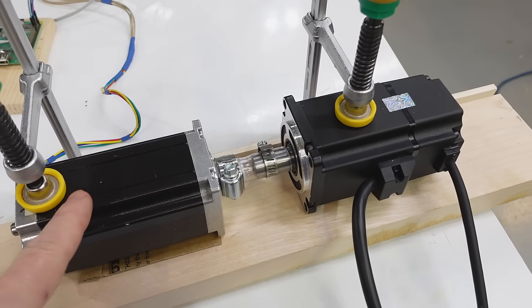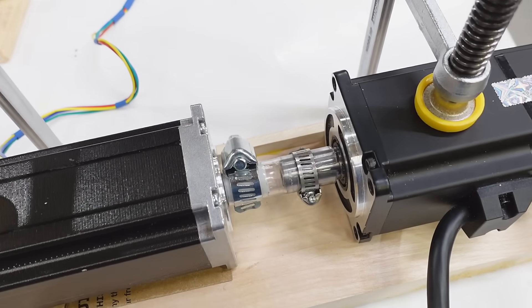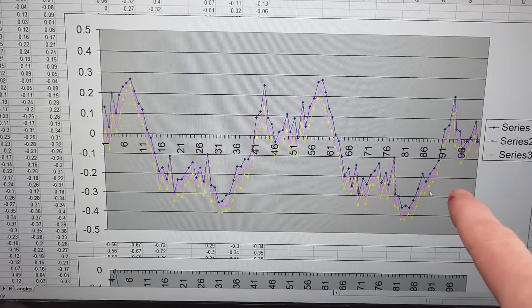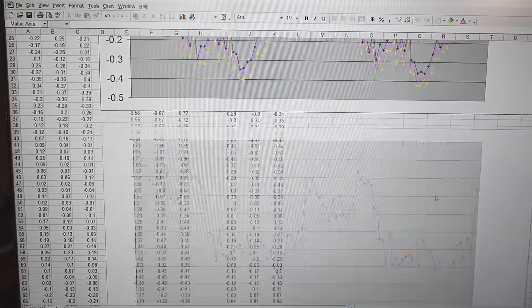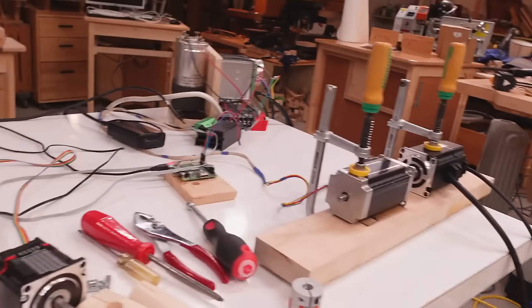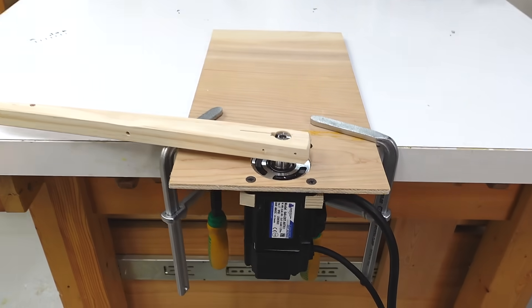I set up a test with the stepper motor driving this one and reading the encoder for every position, but that was also tricky. First I used a rigid coupling but that wasn't accurate enough, then I switched to a hose but that creeps over time. Really what I need is a proper coupling but I haven't received it yet. Here's my graph of angle differences — two turns across the graph, six turns total, three traces. Looking at the yellow trace we see about 0.5 degrees of angle variation. I tried decoupling and changing relative rotation, and even tried magnetizing the encoder, but that didn't seem to make much difference. So I'm really none the wiser — most of the error is probably coming from the coupling.